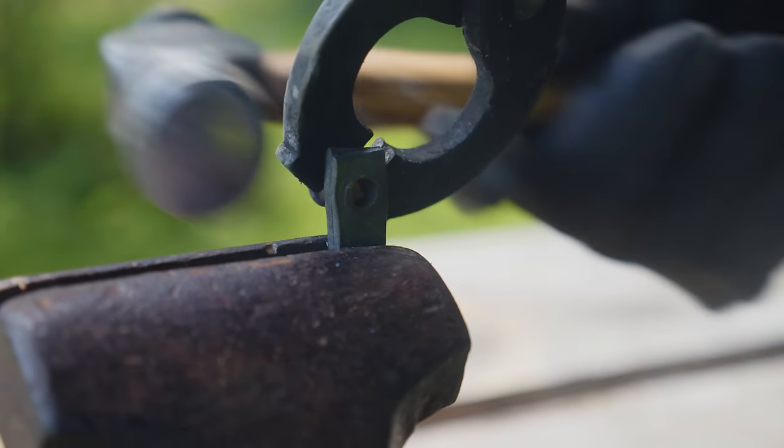Now you could come over here to the other side, haven't moved it. That mark is the same distance from the edge. You can flip it over and do the other side. Once again, the same measurement. And that's how you're able to make things look symmetrical, because you have consistent measurements. And even if you don't have a tape measure or a rule or anything like that, this will work too, because you're just setting it to the measurement and then using that same setting for everything else.